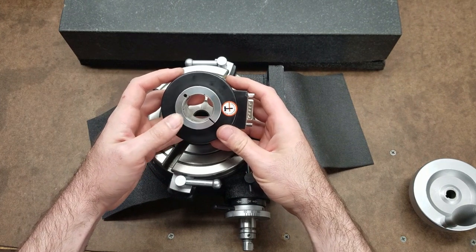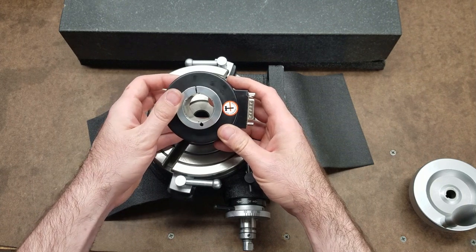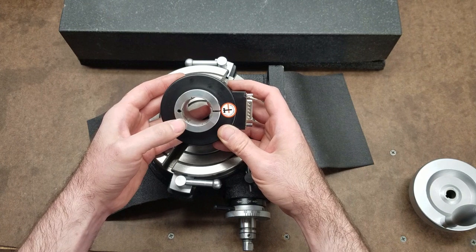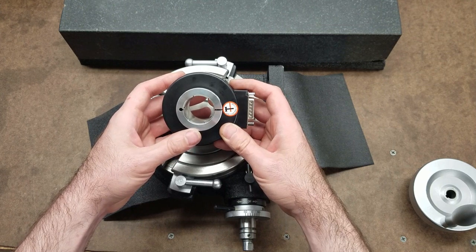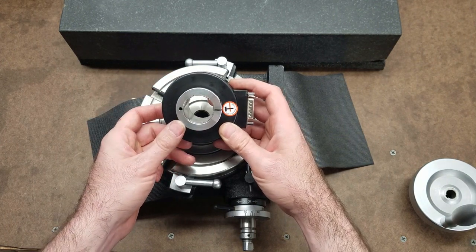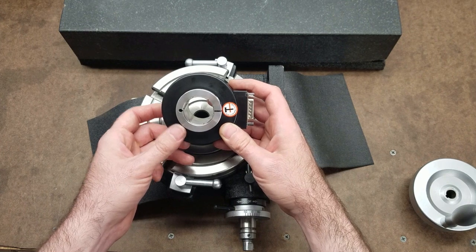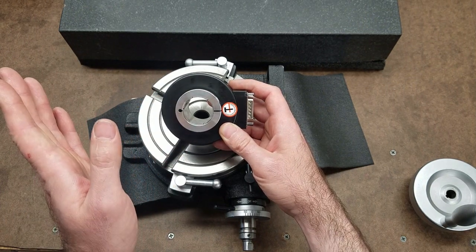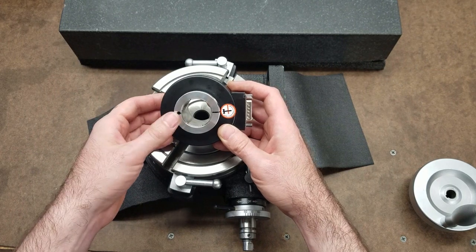So as for the rotary encoder itself, it's a 30 millimeter ID, 3600 pulse per revolution hollow shaft encoder. Now it nominally has 3600 pulses every time you go around. It'll count 3600 times, but in actuality it has 14,400, because there's actually two encoder disks inside this, both with 3600 marks, and the encoder reads, so that doubles the 3600, but the encoder also reads the rising and falling edges of the stripe, which doubles it again, which makes 14,400 pulses.